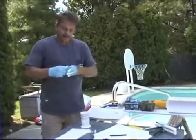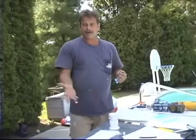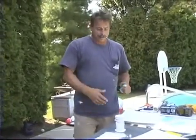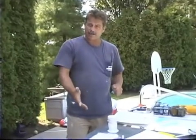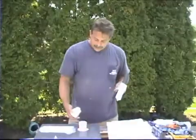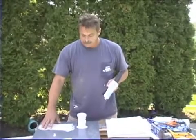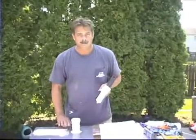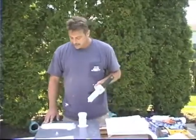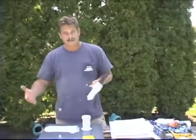The product dries white, stays white, is impermeable by water, and chemical resistant. For you in the field, you're conducting a repair in a very small fraction of the time it would take to replace a skimmer or a main drain sump. Most of these repairs would normally require the water to be drained, but you can conduct every single one of these repairs wet using diving equipment and do it underwater. We've demonstrated several different repairs here: hydrostatic valve repairs, simulated crack repairs in sumps, and this flat application where we manufactured our own patches — which would also work in skimmer repairs and several other repairs around a fiberglass pool. Anything you need a radius: you can take that flat patch and spread it into a radius to make your patch fit the damaged area.